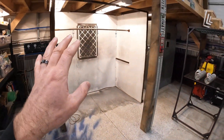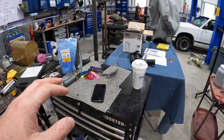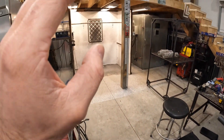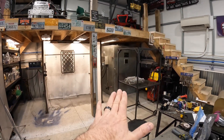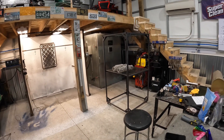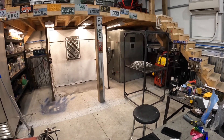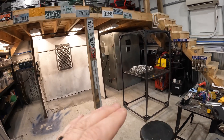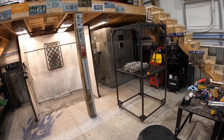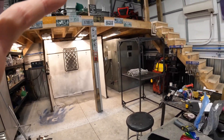What we're going to do is clean up the booth from the other color we just got done spraying, clean out the oven because we're changing colors, and clean out the gun. We'll load up our base — the Illusion Red — lay that on there, then it goes in the oven and flows out or gels out. The oven is set to 375. When you put the parts in, you're not worried about part temperature. As soon as they flow out or gel out, add two minutes, then take them out, let them cool, and apply the clear.